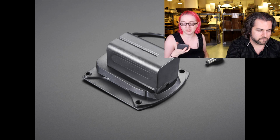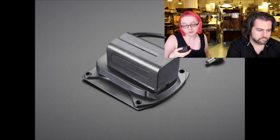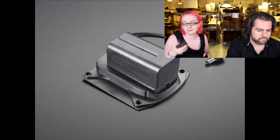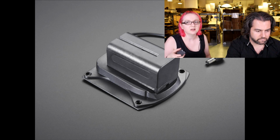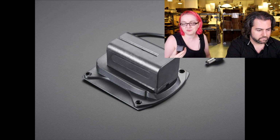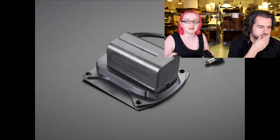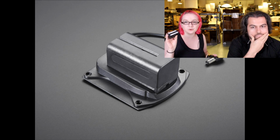And people really like lithium-ion batteries, and so these are camcorder batteries. This is actually really seriously old. These are at least like 10 years old in design. They're still used for camcorders as Sony NP-F750 or 770 or 550 or 570. This is a fairly easy to find camcorder battery. They're chunky, but they work very well. They're internally balanced, and you can get chargers for them. And it's 7.4-ish volts output.